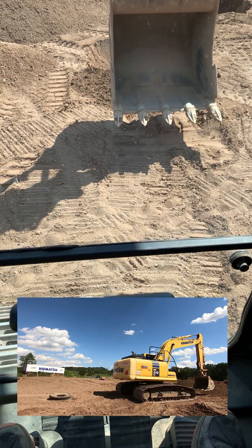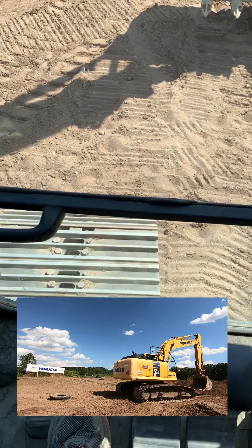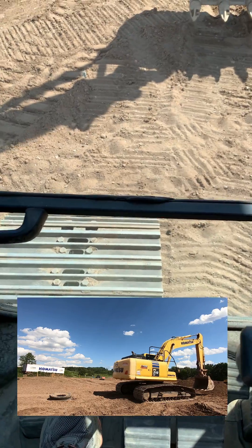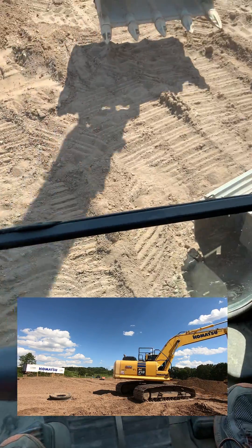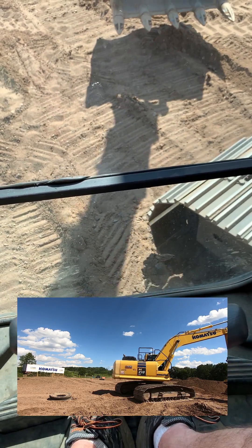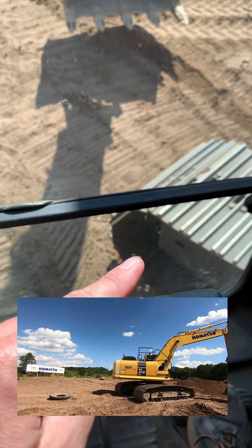Okay, this is driving, traveling, transporting an excavator — whatever you want to call it. Generally you want to be squared to your tracks. I usually tell people to look down and line up the bottom of the window with the tracks. Driving sideways — it really doesn't matter track-wise, but it's just really disorienting. Your tracks, you usually want to be in line.